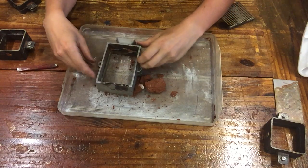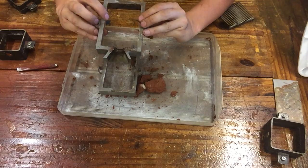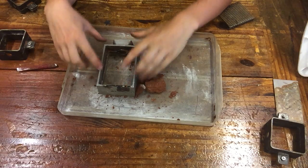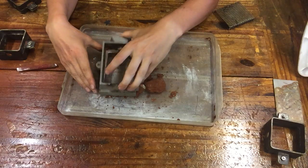This also has really terrible registration in that the hole tolerancing is very sloppy, and each frame has a little drafted portion that's supposed to allow separation. But what it often does is when metal casts around it, it can lock parts together and make it really hard to remove.